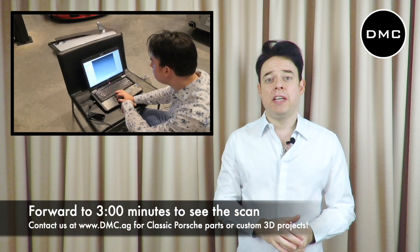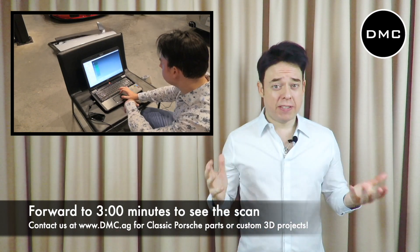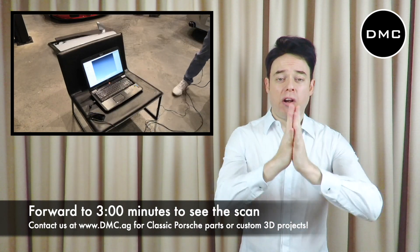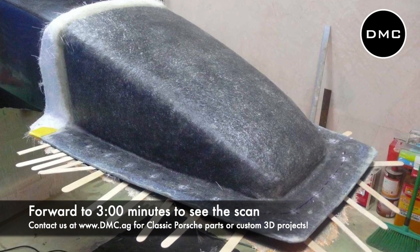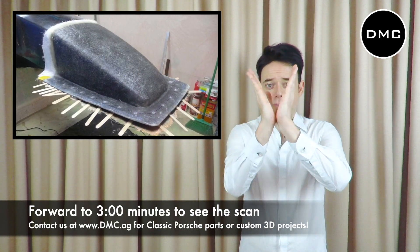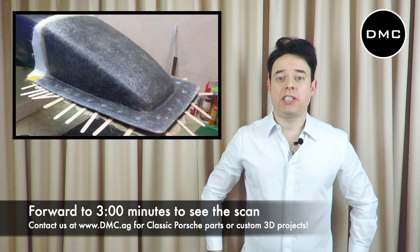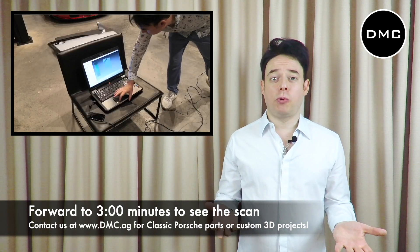Nowadays this is all totally different, but I'd like to say a few words about it so we have a better understanding of what's changed. Once you finished the design back then, you still needed to go into production, and the only way to do that was to make a mold around that new product — think of it like a negative image. Here's your new bumper, and you form another mold completely around it, which when opened creates a negative mold.